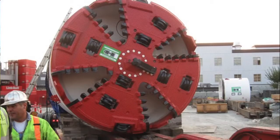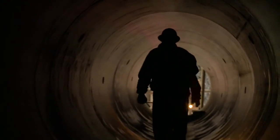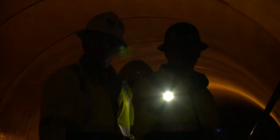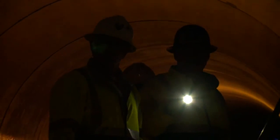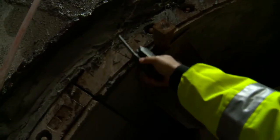The specifications for the job said it had to be an EPB TBM. We chose a Herrenknecht EPB TBM. The biggest challenge about this project was the diameter of the machine — it wasn't that great — and the thickness of the segment, so that gave us very little room to work within the machine itself. The segments that lined the tunnel, the six pieces, were essentially very thick for this size machine.